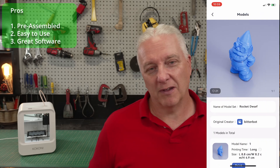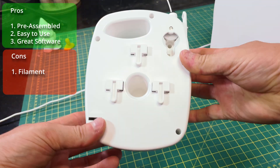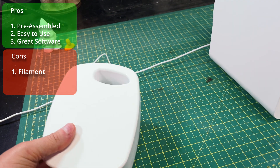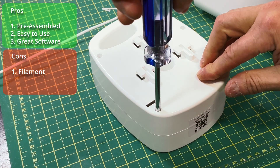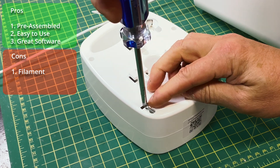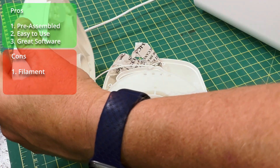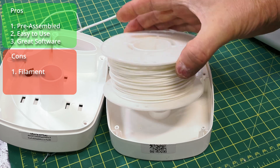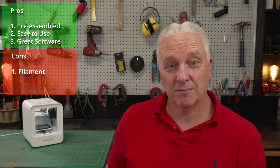Everything is push button — it's literally a case of selecting a shape and hitting the print button and watching it print. There were a couple of things I think they could improve. First is the use of these filament cartridges — I know why they're using them, they're trying to keep complexity away, but if you're not mechanically inclined you're going to end up always buying your filament from Kokoni. It's really good filament, but you're probably paying a premium. Now you can crack these things open — there are five screws on the box — and you can see it's just a spool full of filament. You will have to wind your own filament on there and it will most likely need to be PLA, but PLA is really the most common filament especially when you're just starting out as a maker.